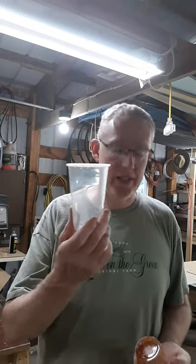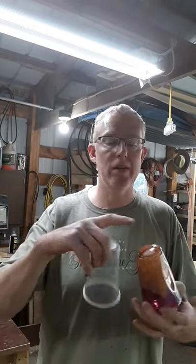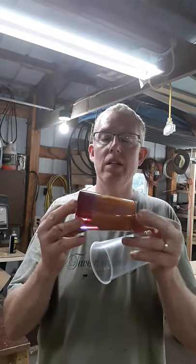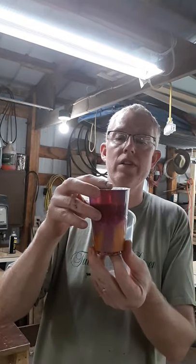Earlier in the video, I used way too much epoxy when I was mixing. Didn't measure well at all. So what I did was I took this plastic cup, I made a pine blank that was relatively round before the epoxy set up, put some 5-minute epoxy on the bottom, glued the pine blank in the cup so it wouldn't float to the top, made a little more epoxy, tinted it, and poured it in this cup. It's been several days now and that's cured, so what we'll do is we'll put this on the lathe in the next video and turn it into an egg.